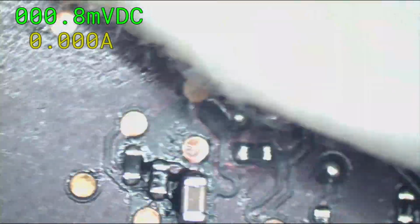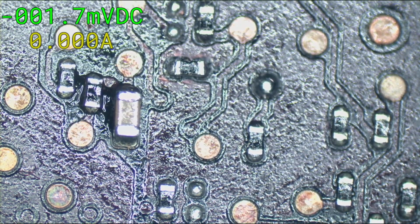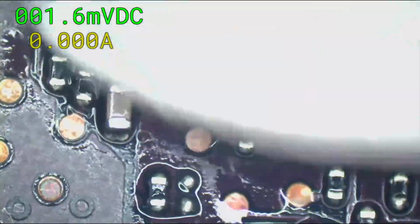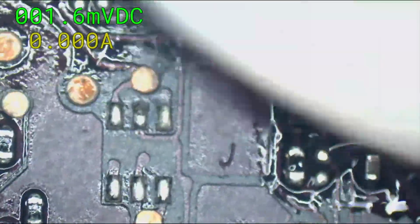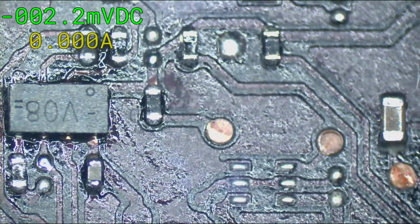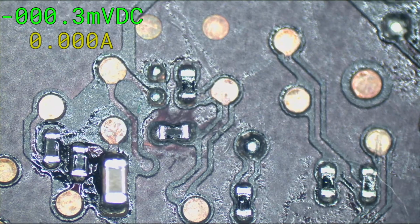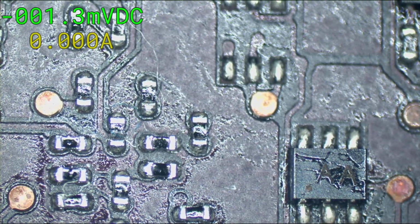Look at that, my cleanup wasn't even that bad. You don't have to UC the board when I'm done with it. Although, this one has liquid damage. This one will be getting UC'd. There you go, new U1950, a couple of resistors there, a backlight resistor there. I do see a little bit more liquid damage off to the side here.